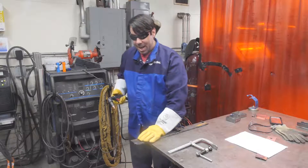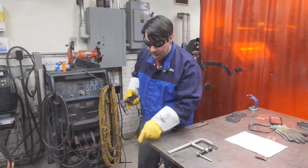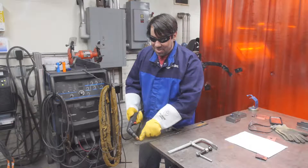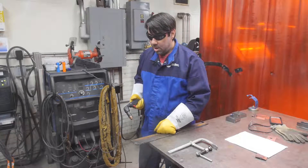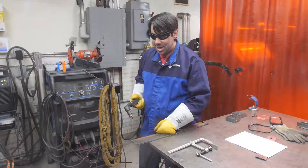When using this plasma unit, there are two methods of making cuts. We can begin the cut at the edge of our workpiece and cut along our desired path. Or we can begin the cut in the middle of our workpiece, which requires us to pierce the workpiece to make the cut. The first method is more common, and that's the one I'll begin with during this TA demonstration.